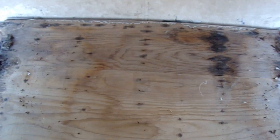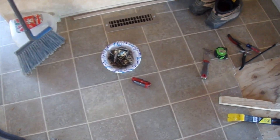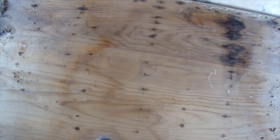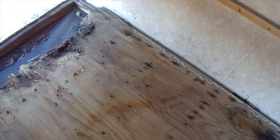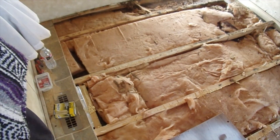I could probably get away with just a four-by-eight sheet in here but you can see it's pretty soft. I'm going back six feet — we're taking out six feet and replacing it. If I have to I'll go down along the edges with some other material. I'll run the saw down along that seam right there, pull that up, replace that one board, and that's going to be my base for starting measurements.